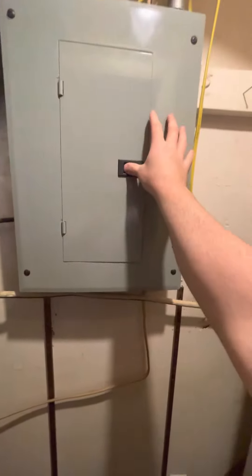I'll keep rolling — the outdoor unit is just right back here. The outdoor unit is unmarked. You can see the lines coming out and the drain, which looks like it's terminating and just running off down to the street. It's sitting on some old blocking, so we'll need to bring out a new pad, redo the disconnect, and get that new unit set up on there.